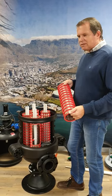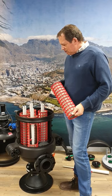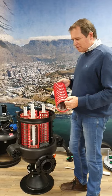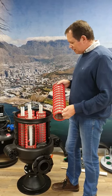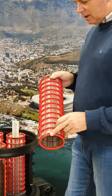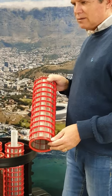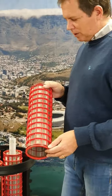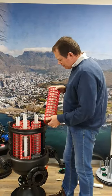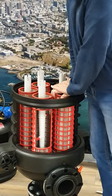You've brought your clean screens back. For the training video, I'm going to demonstrate how to assemble it physically. Before you install your screens back into your filter, you will see that there's an o-ring at the bottom and the top. It's wise to lubricate these with a silicone-based lubricant — that will make your life much easier. Then just put the screen back and push down on it until you feel that it's seated.